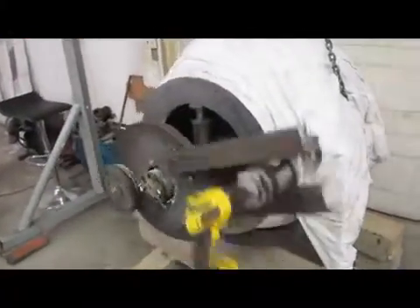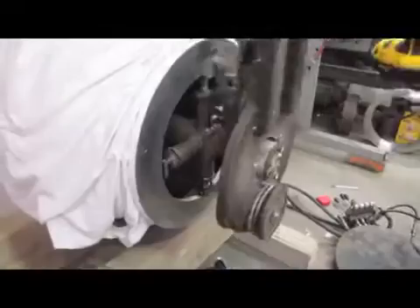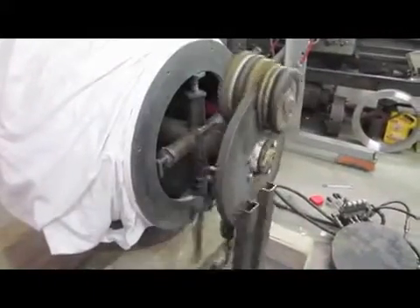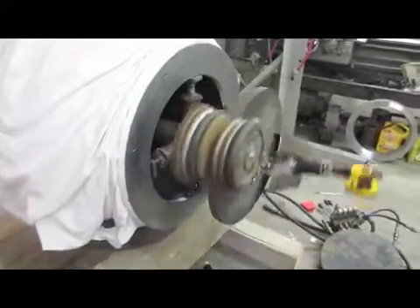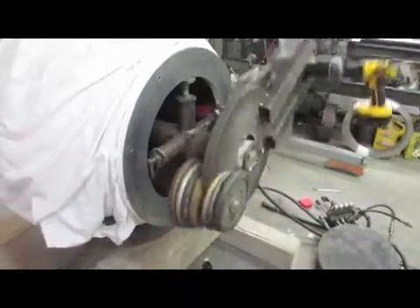The submarine face is all done. I expect this will take about four or five hours — it takes 20 minutes to make one pass and I can take 10 thou off in a pass no problem. This one doesn't need much, so probably four passes to do it. I do a finishing pass on the end to make it nice and smooth.